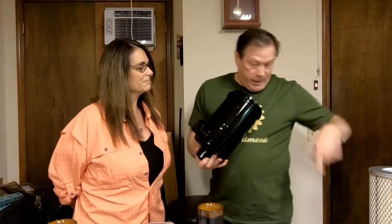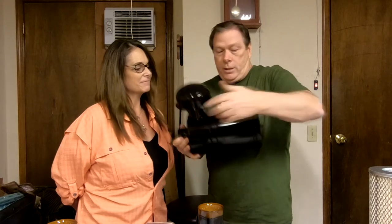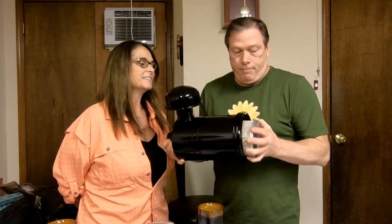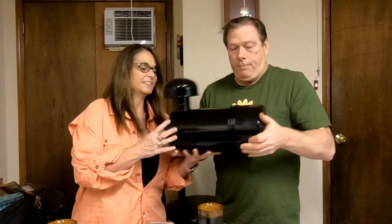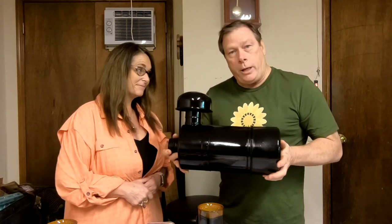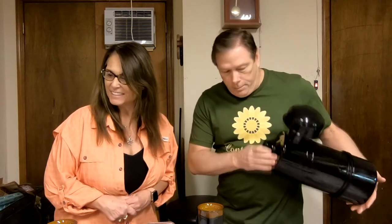Robert, this is the air cleaner off of the backhoe. It looked like some of that other rusty nasty ugly stuff you saw. And Robert did an excellent job of restoring this thing. We've got a new air filter to go in it — goes in like that. Then there's a screw that goes on it to hold it in. This snaps on like that, and then there's a little ring that goes across here to hold it on. So the air cleaner is ready to go. So far we've got the air cleaner, oil filter, the starter, and the generator — all patched up and ready to go.